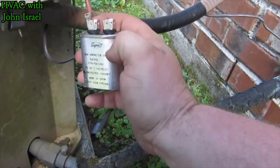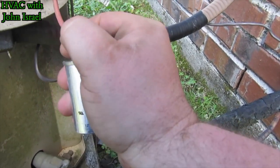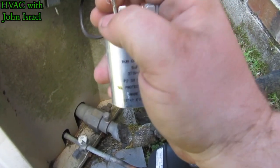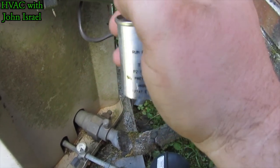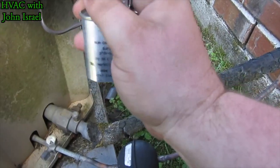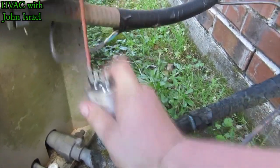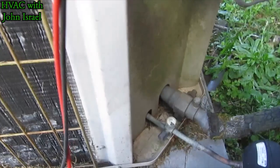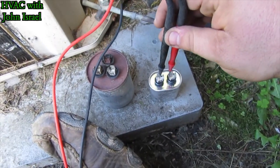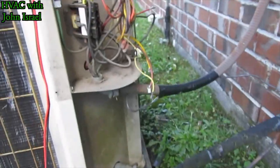Okay, that's my yellow for the fan. Now I'm trying to get this thing off with one hand. I don't think it's a capacitor issue. I think the contactor's bad, or we're not getting power, or we have a bad breaker or something, but we're gonna find out. We're also gonna recommend that they let me replace that disconnect while I'm here. There, I'm trying to do this with one hand, fellas. On it too hard. There we go. It's a 5. It's good. All right, it's not a capacitor issue, so we will mount that one back and then we'll put